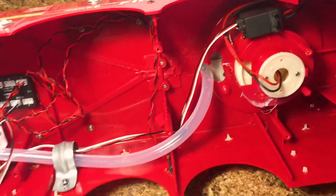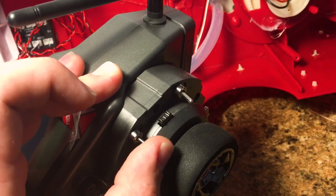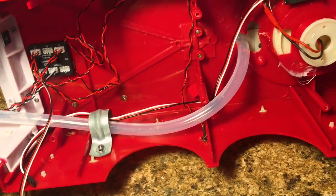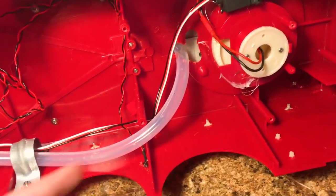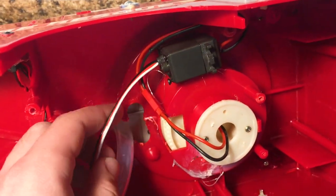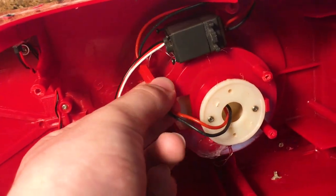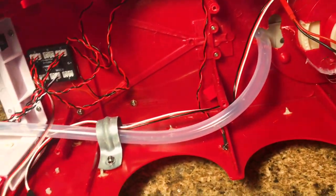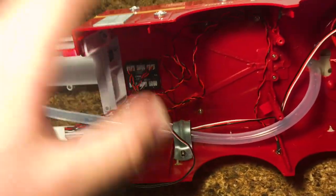And then basically what you have is just an electrical cutoff in between the servo and the outlet of the power. So when I hit the switch, it actually acts as a winch controller and can raise and lower my ladder just like a winch controller would. And you could do this for an actual winch on your rock crawler or for any other project. So I just put it in the box of an old servo here too, so that it stays somewhat waterproof. We've got the wire here that's going to go to our receiver, and then we've got the two JST plug wires right here going to the motor within the ladder. So what I'm going to do is put these two plugs into the chassis so that you guys can see everything motorized up.